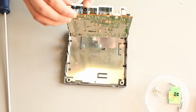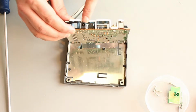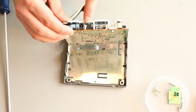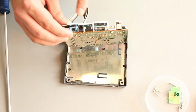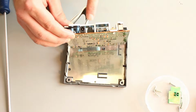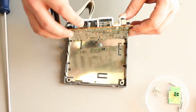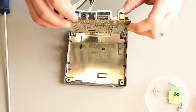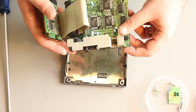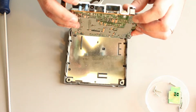This power supply is 9 volt center cold. That means the center's negative, the outside's hot. That is the same format as the Master System and the Mega Drive version 1, not the Mega Drive 2. The Mega Drive 2 is center pin hot, so those power supplies are not compatible. I imagine if someone plugged center hot in here, it would probably blow that fuse, or if they plugged 15 volts instead of 9, it would blow the fuse, that kind of stuff. So something pretty common to look for, a blown fuse.